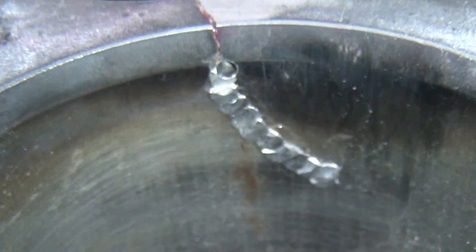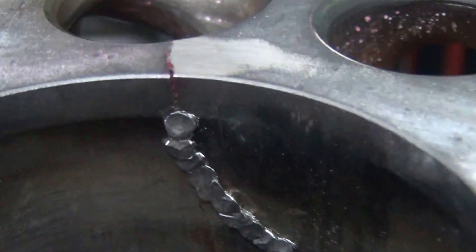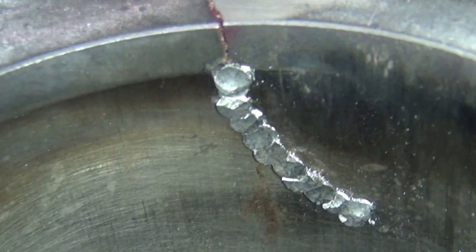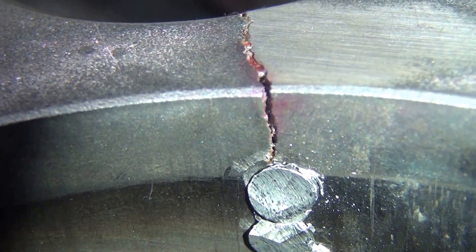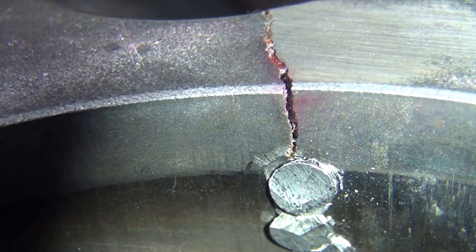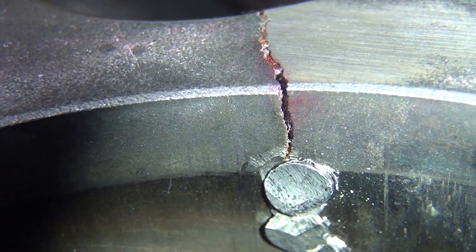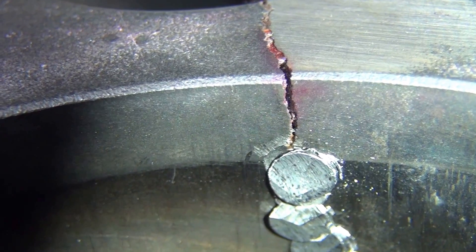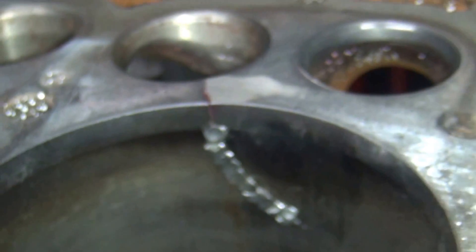I'm going to put a couple of tapered pins in here before I switch over to the other style — got no choice now. You can see I'm off the side of it a little bit there. I can see the undercut right above my plug on the left side corner at about the 10–11 o'clock position. So I'm going to go ahead and put another pin straight down the line of that crack this time, instead of going at an angle — go straight into it and hopefully most of the off-center hole will get covered up with another pin.